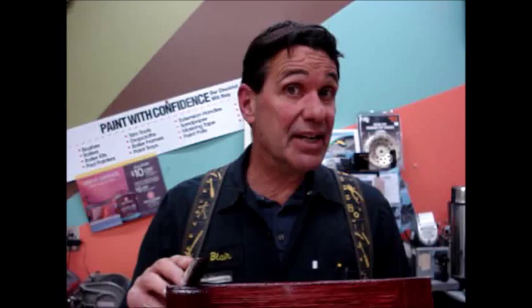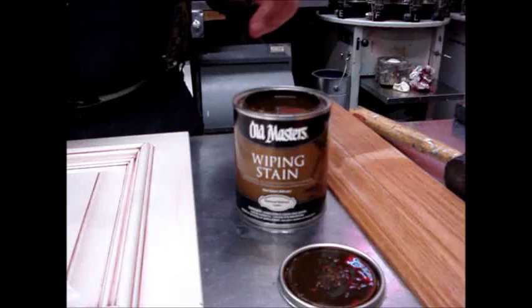Here to show you how we can antique and put grain onto enameled surfaces, heat registers, or take an existing stained board and make it a little darker, or a lot darker for that matter. The surface we started with was just a little bit slippery, so the ink didn't just soak right into the surface. You cannot do this on flat latex paint — you end up just painting it; it will not take and accept any graining. That's an enameled wooden door.